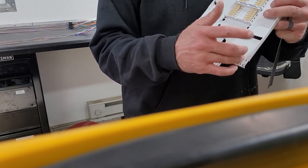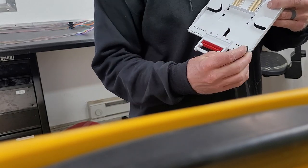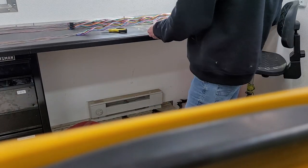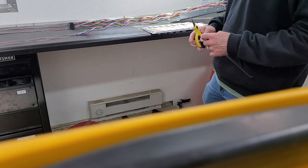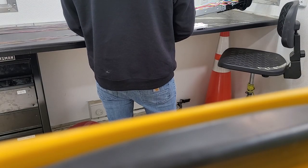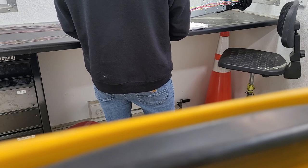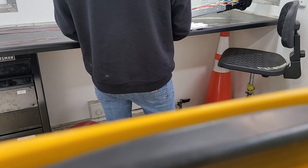I call them baby zips. We'll put the baby zips through here, and then the buffer tube will have this wrapped around it to offer a bit of protection, so whenever you pull that zip tie tight, it's not choking the tube directly. And also it gives kind of an anchoring point, a tension relief, making it harder to pull that buffer tube out of the tray.